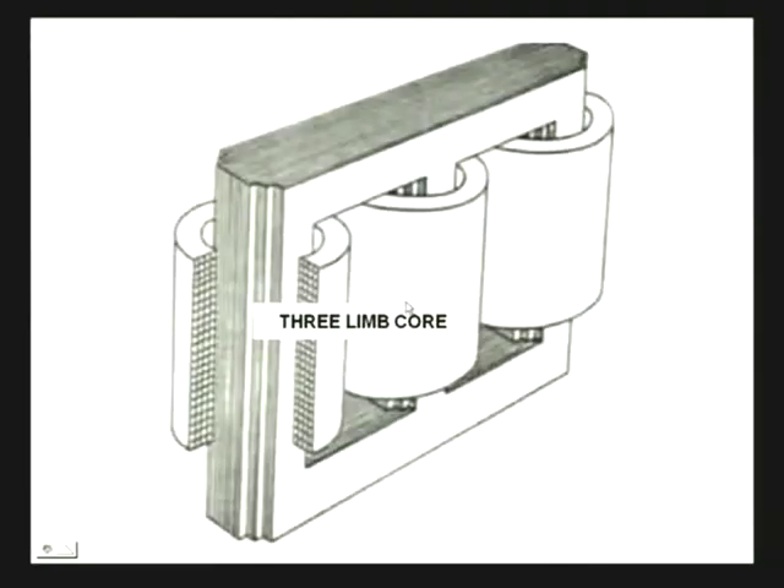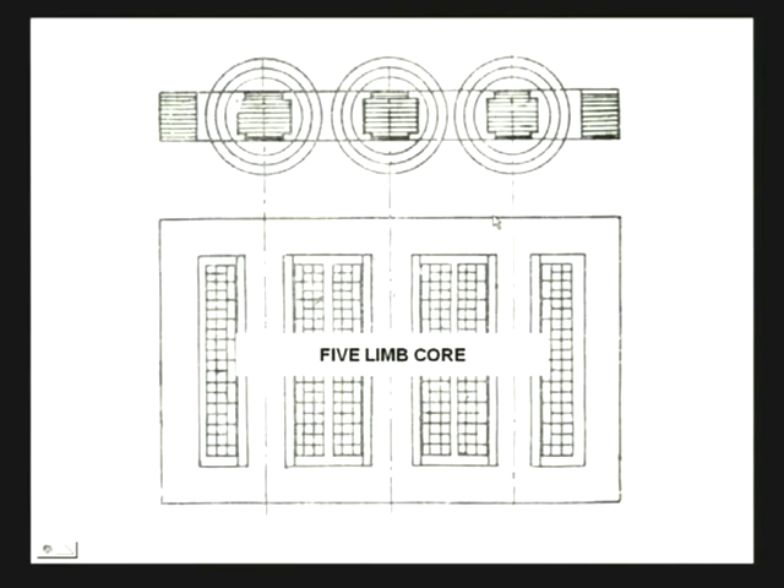The essential part of the transformer consists of a core with windings on the limbs. As seen in the last lecture, a three-phase transformer built as a single unit can be made up of three limbs. The returned limb for the flux is not necessary since the sum of the fluxes are zero. However, this three-limb construction does offer slight imbalance to the flux path. Therefore, for very large transformers, a five-limb construction is used, where the windings are placed on the inner limbs and the two outer limbs do not carry any winding. This provides a more balanced magnetic path for the three-phase flux, and the phases operate more or less independently of each other under balanced operating conditions.